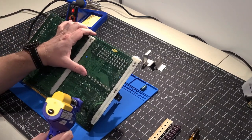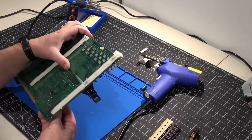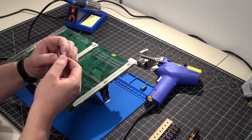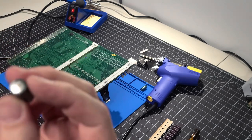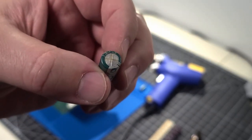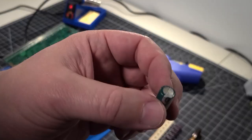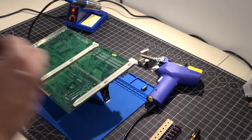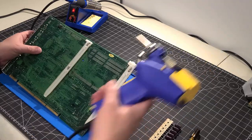Looking a lot better now. I was able to wiggle that last one out. I used to do all this with just a soldering gun, but I went out and purchased this desoldering tool and it makes a huge difference. This was the worst of the capacitors — you can see the staining on top of it. Not all caps will go bad like this; some will still function fine. Unfortunately in this case, that wasn't the situation. All three caps are now removed.